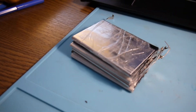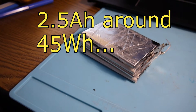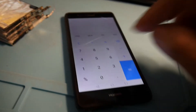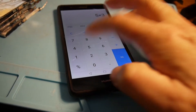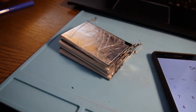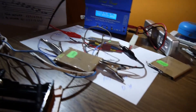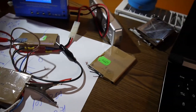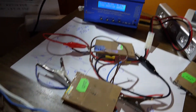That's how I'm going to have a power supply around 2.5 amps at around 21 volts. If we consider 5 cells at 3.8 volts each, we have 19 volts, so this should supply the laptop for another couple of hours at least. Step 2 is checking all the cells for capacity because I need a clear image of how good they are and how to put them together.